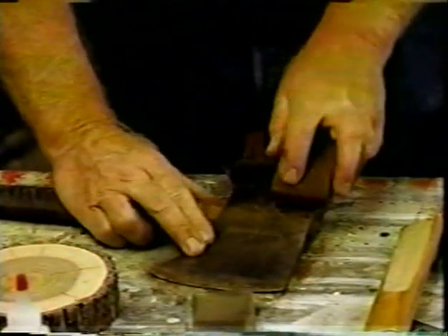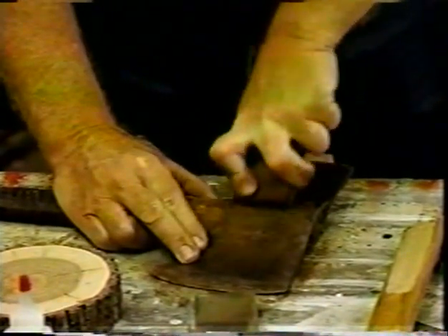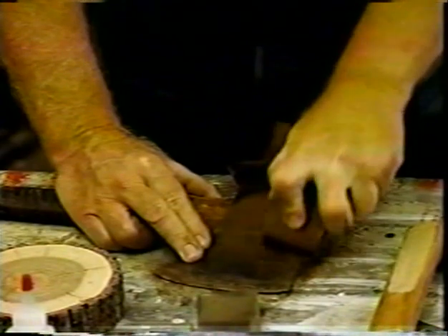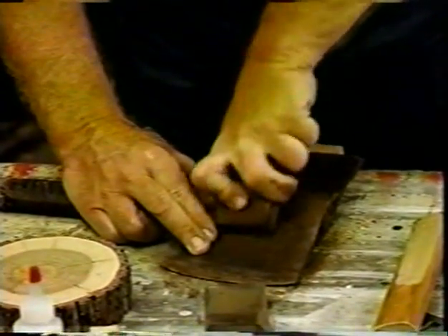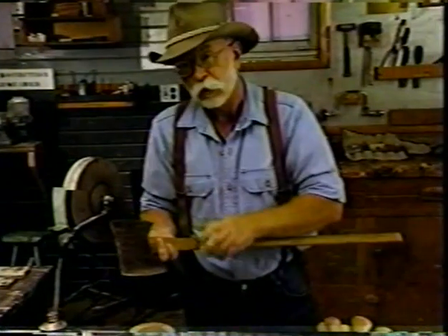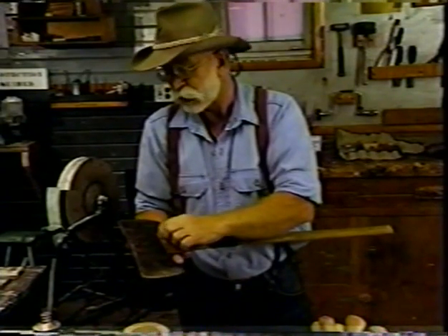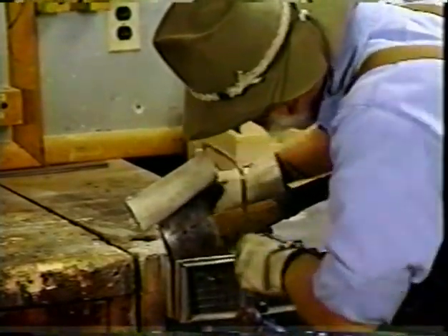They're inexpensive, they're great. You just scrub it like that and it takes the rust off, cleans it up. They're good for taking pitch when you're using your axe in the woods. The first thing we're going to do is saw the old handle off at this point right here. I just prefer a coping saw because it keeps it nice and close.